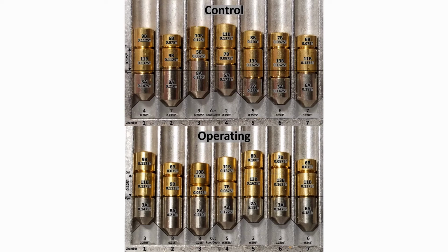So it's not necessarily that it could be at the control, but certainly we know we're not going to master pin the control shear line. We're going to master pin the operating shear line. So that gives you a lot better chance to hit the operating shear line. But in this case, you could hit the control shear line first. So the whole point of this exercise was to talk about why some locks are easier to pick than others.